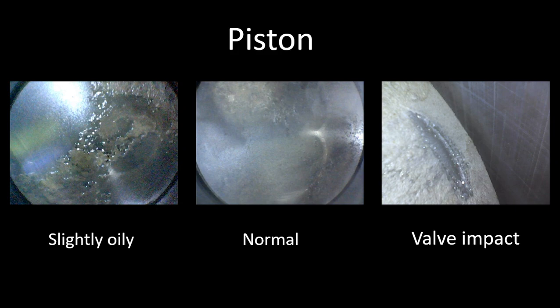The center photo is pretty normal — normally pistons are pretty dry. Some of them will have more buildup on them than others depending on how they run the engine. If it's rich of peak, lean of peak, and how much time is on the engine will change the amount of deposits on the piston.